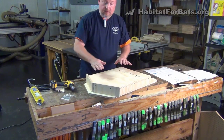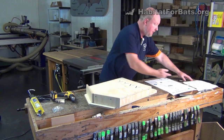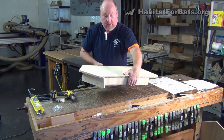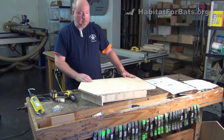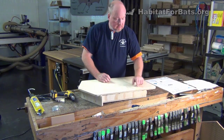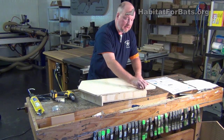Now the front is done and we're going to turn this over face down to continue. Be careful — we haven't put the screws in the back yet, so the back panel can actually fall off. Grab it by the back panel so you have a hold of it, and turn the entire bat house over. Support the weight under it, not just by the back panel. Now that it's turned over, all of the holes can be utilized to put the screws in. If you think a hole is missing, look close — there can be a little fleck of plywood left; find it and just punch it out, then put the screw in.